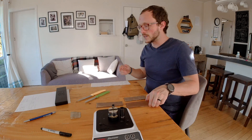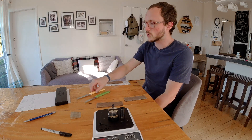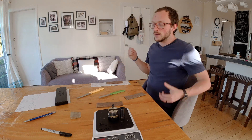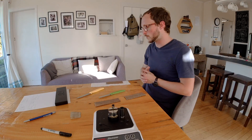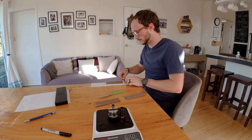The plan is to take the highest number to the biggest abrasive — so yellow goes to the CBN 2 micron, giving each of them 10 strokes. Then the green will go to the Venev 1 micron next. If one of them gets worse, I'll reset it quickly on the Spyderco ultra fine and retest. If not, I'll take both of them to the 0.1 micron Gunny Juice to see if we can get the number even better. In my last test I found that the Gunny Juice was perhaps not the best for big deburring work — at 0.1 micron it seems a little better for refining work — so I'll try to keep it in its intended scope. Let's get into it.